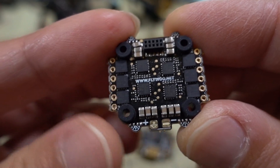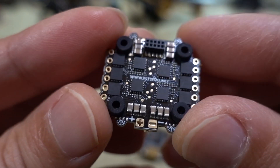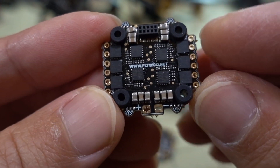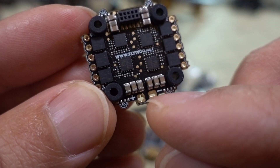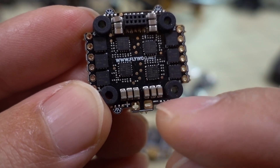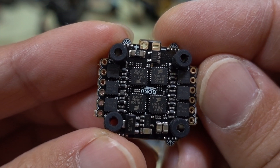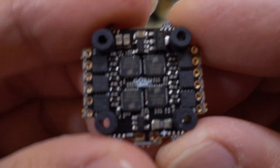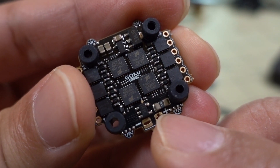Here's a closer look at the 4-in-1 ESC. There are no LEDs on the ESC — those are just on the flight controller. All through holes are provided for your motor wires and battery lead, so you put your capacitor through there. There are some onboard filter capacitors as well. The FETs are on the bottom, with the controllers on the side, and there does appear to be a current sensor on the bottom — a pretty small one.